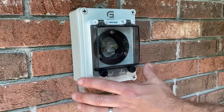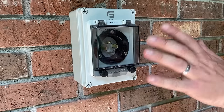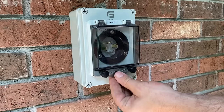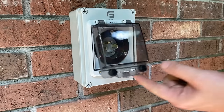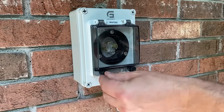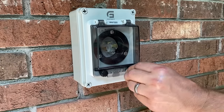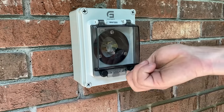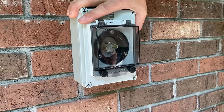That's it - it's all nice and safe and secure. I like this particular inlet box because you have the clear panel on the front so you can see exactly what it is if you're just walking by, and it has a kind of extra safety feature. These screw in so that just in case the breaker was somehow left on inside, no one could stick their hand in there. It's got these little twist locks on each side and you can actually run a zip tie through here or one of those little cable locks to actually lock this door shut so that no one - kids or otherwise - could get in there. Now that we have this done, nice and secure, level and screwed down to the outside, all wired up, we're going to go inside and install the interlock kit for the breaker.